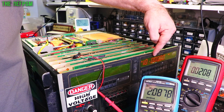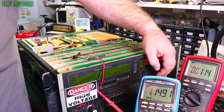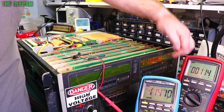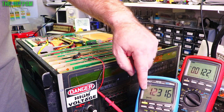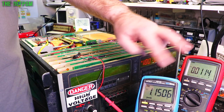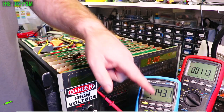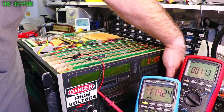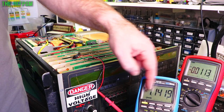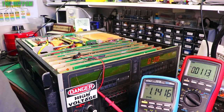And you can see on this particular range, on a 10 millivolt range, we're getting 20 millivolts output, and this is wrong. If I go to 0 scale, I can't get it down there. So that's definitely wrong. Let's do 1 millivolt. Same deal, 1 millivolt, can't get it down there. We're getting 1 volt on the test point, and 12 millivolts down there. So we can't actually get that drop off, so the voltage is not nulling out like it should be. Go back to 0, it's just not nulling, because this voltage shouldn't be there. If I reverse to a negative voltage, we get the exact opposite. So the nulling point is not there. Something's dragging it off. Something's pulling the voltage up a little bit. And that's what we've got to try and find.